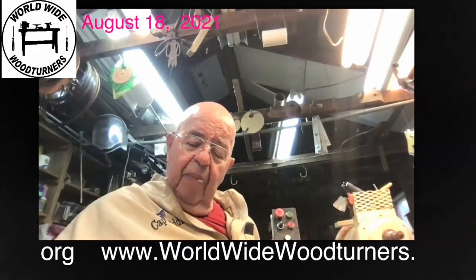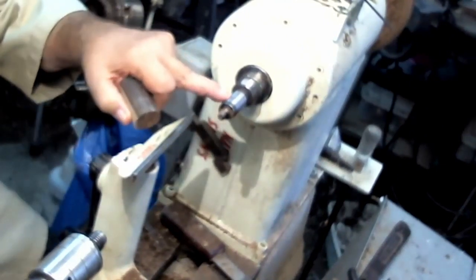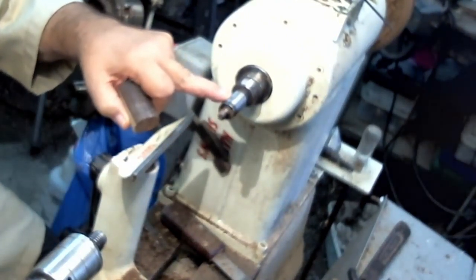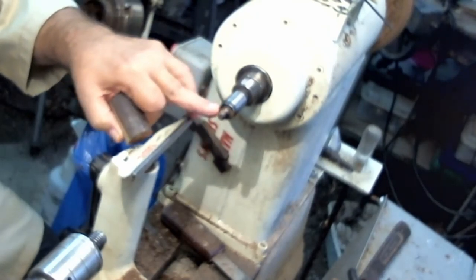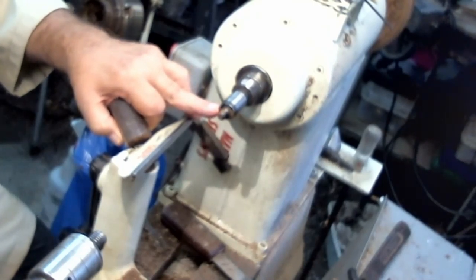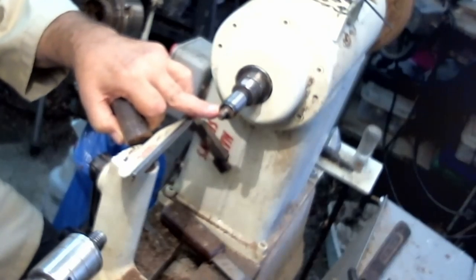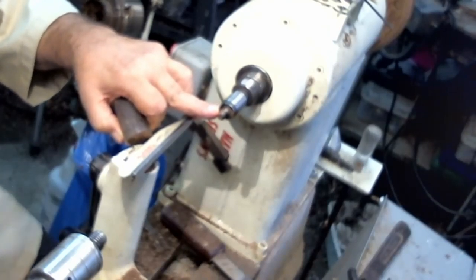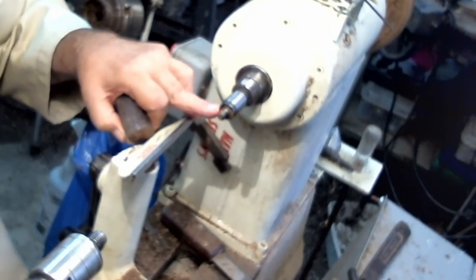All right, I'm going to pop back over here, and y'all bear with me. This is the chuck, and it is a mandrel. That face of it right there at the end is the same size as the socket on the bottle stoppers I'm using. I'm using a stainless steel product. Mine's colored to a gold, and I have a couple other ones. But it's the same size. That is a key size. I don't want to go smaller. I can be larger and have it finished.